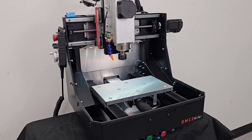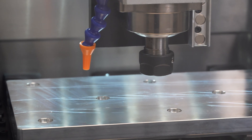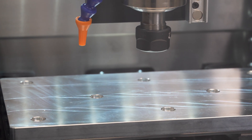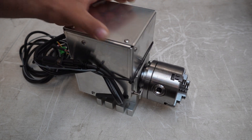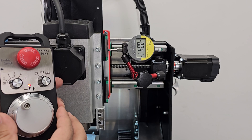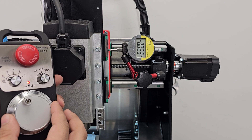So first of all, what is the DMC2 Mini? As the name suggests, this is our smaller version of the popular DMC2 CNC machine that we've been selling for some time now. The DMC2 Mini is a three axis, upgradable to four axis, metal cutting desktop CNC machine kit that is designed with one main goal: to provide machine shop quality 0.01 millimeter tolerances in all metals at an affordable price tag in a compact package.